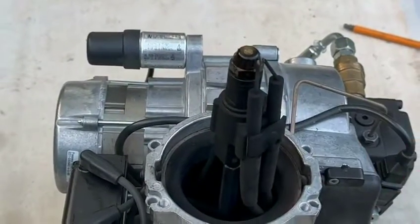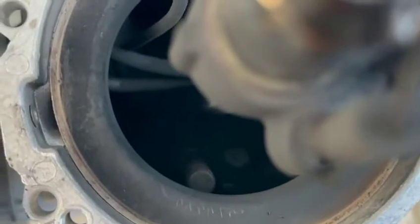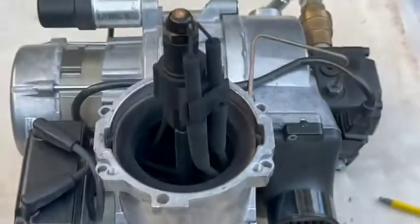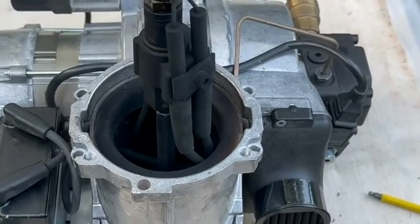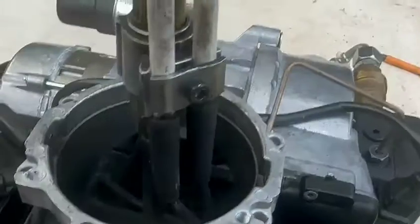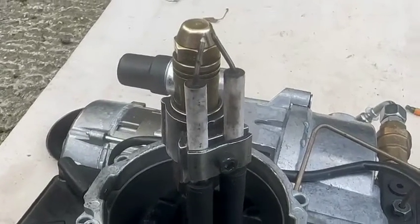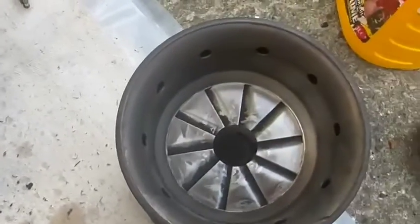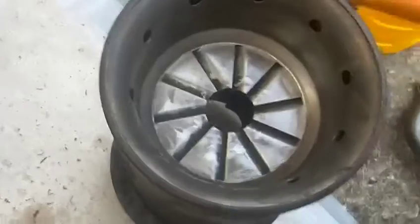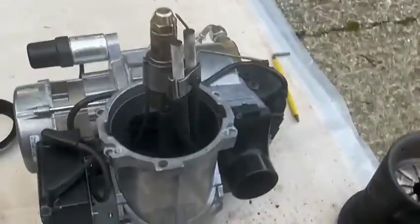So I'm going to give this a really good clean up, change the nozzle, and clearly clean that. I can see the photocell just down there - look how dirty it is. That's saying 'help me, I can't see a light' - and that's shutting it down. It's a safety feature, which is a great feature. I've cleaned the head up and that's the best I can get it. I've spent 15 minutes on it and can't get it any cleaner - they're very stained and getting a little bit tired. I just need to take a little bit more out here and here, then I'll put it all back together and move on to the photocell.